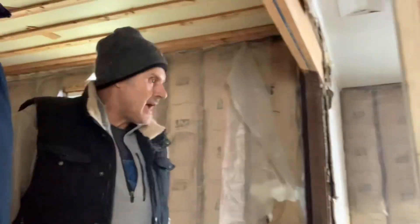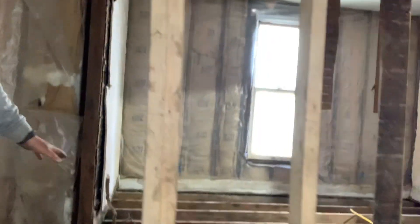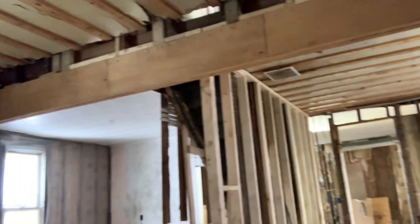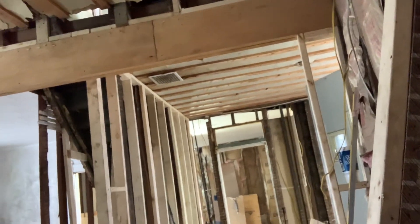After that, we're going to put new sheeting down and we're getting all the floors level. Then we're going to start the wiring and the drywall. We also put a header in up here and we'll be putting another one at the other end — there was no header up top here. We use LVLs; everything's done by code. It's an LVL header, and that's the support that the joists from the upstairs flooring needed.